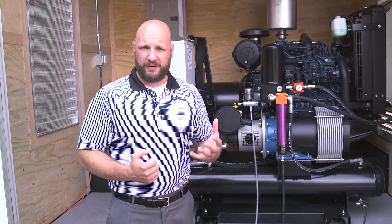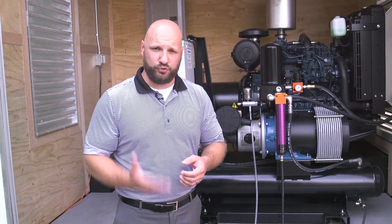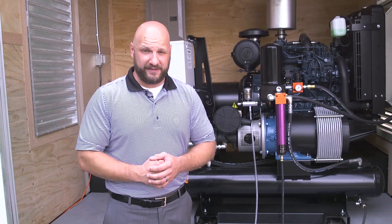The second way to lose profits: if your air dryer doesn't meet the inlet air temperature requirement. There are a lot of inexpensive, sub-premium air dryers out there rated for only 125 degrees of air temperature. If you're pushing 160 to 170 degree air into it, you're completely choking off your air supply, which is costing you money. Make sure you get the right air dryer — call us if you have questions, because that's a very important piece that can save you a lot of money and increase your profitability.